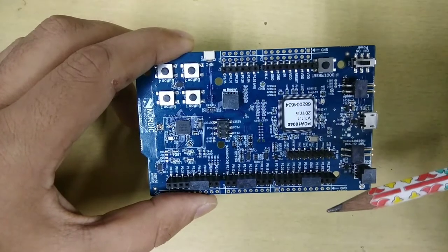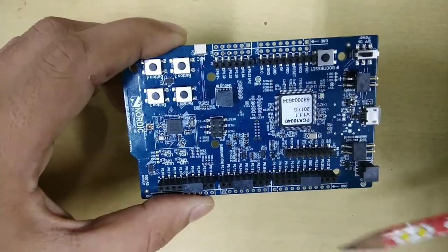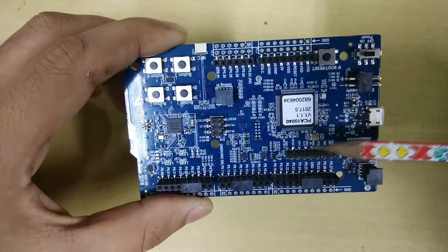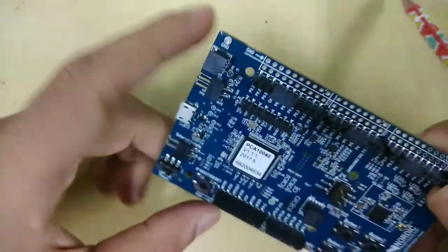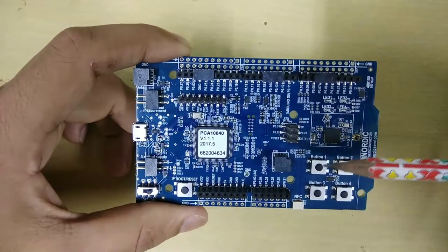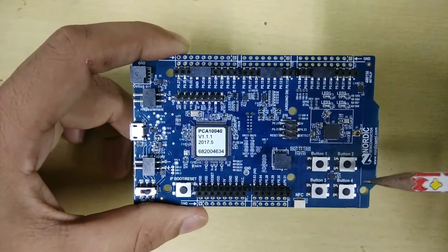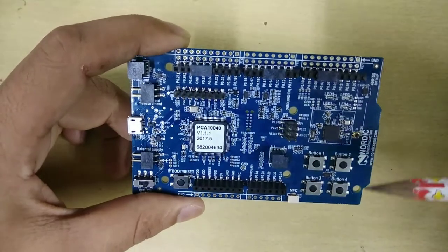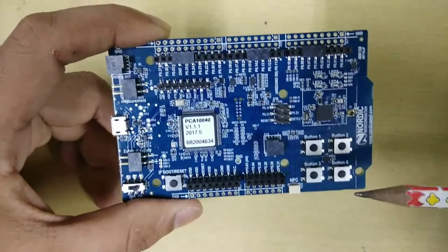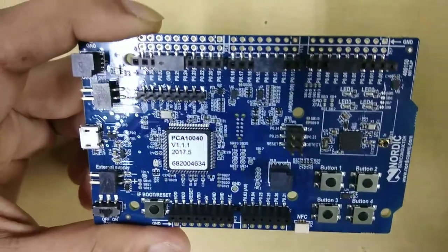You have many platforms to program this NRF — you can program it with IAR, with general purpose GCC compilers, with Keil, or with mbed. Mbed is a really very powerful platform developed by ARM, and Keil is of course an independent IDE available for Windows PC. In the upcoming tutorials, I'll be covering many topics such as Bluetooth, LED, ADC, UART, timer, and also further monitoring systems connecting with external sensors such as 24-bit Sigma-Delta ADC, temperature and humidity sensors, light sensors, air quality, and noise sensors. This will be at least a 20-video series covering each and every detail of the NRF52 development kit. Thank you so much for watching, stay tuned, and subscribe to the channel so you can directly get updates. Bye bye!